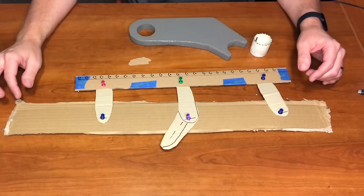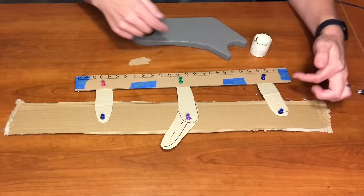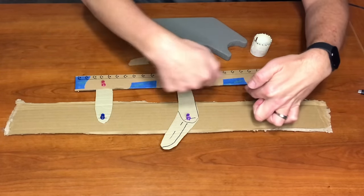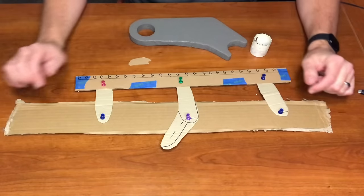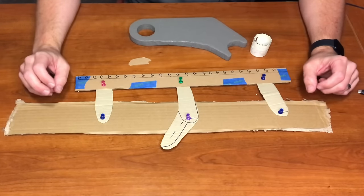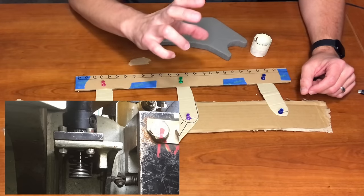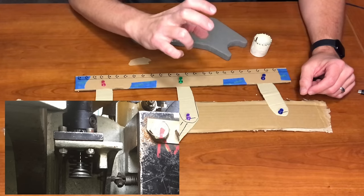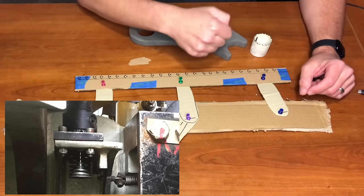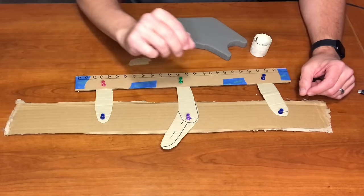And there are also, underneath, shocks, dampeners placed up through there. If the lift is considered a quiet lift, the dampeners are used, they're Enidine shocks. They're a gas-loaded spring shock that not only takes the impact, but it absorbs the force as it closes back down to zero.